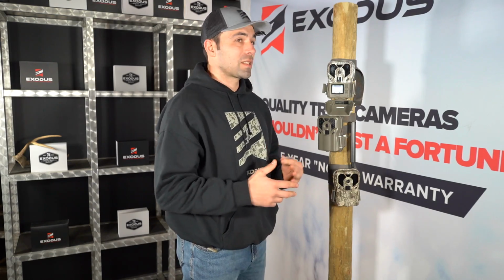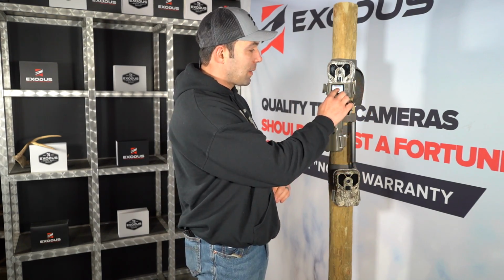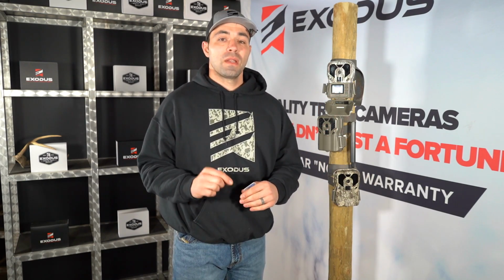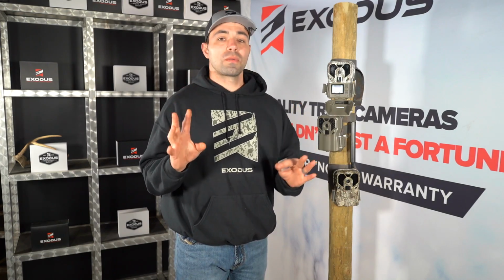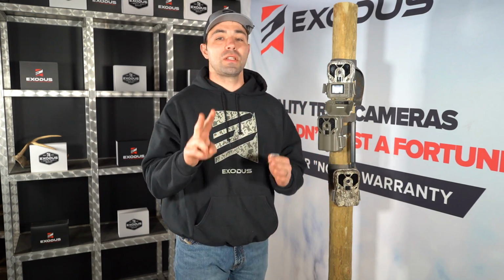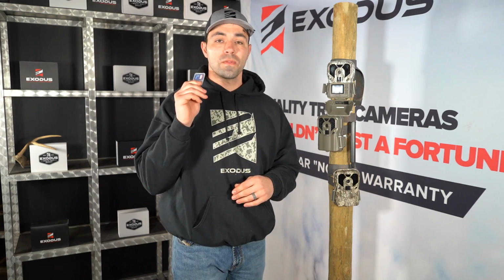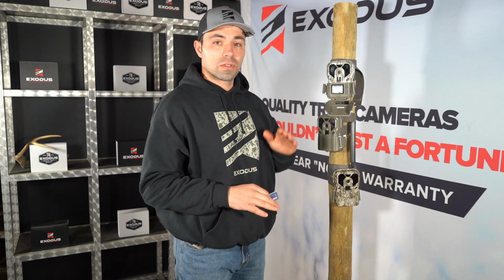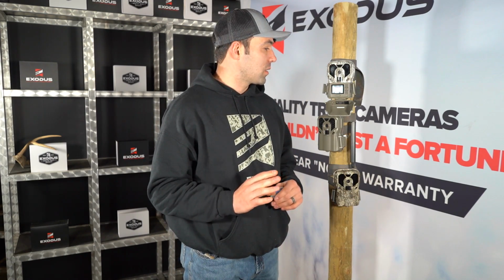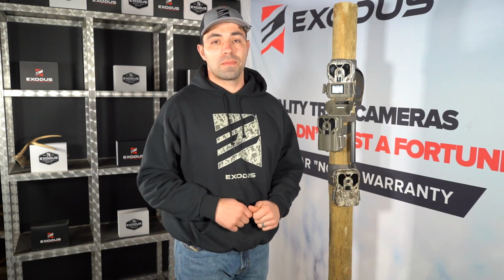So as of today, December 26th, 2019, that camera should be installed with 0917. The last two digits are irrelevant to the DSP firmware that's actually installed on the camera. The last two digits just signify the controller, the MCU firmware on the hardware of the camera. So you can ignore the last two digits, but the four digits to the left of the last two should be 0917.